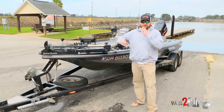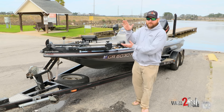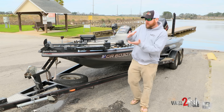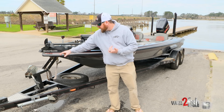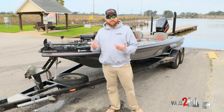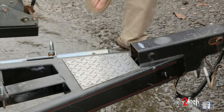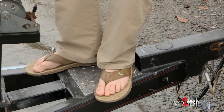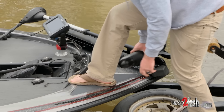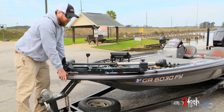When you're backing your boat off the trailer, go back slowly and you'll see the back of your boat start to lift off those back bunks a little bit and float. Keep backing up slow until your bow and your trolling motor mount clear that front roller. When it clears the front roller, put your truck in park and put the e-brake on. Come over to the step, step up, and your boat's going to be floating — so you can reach up and unhook that. Now your boat's floating, it's not going to run away from you, no big deal.